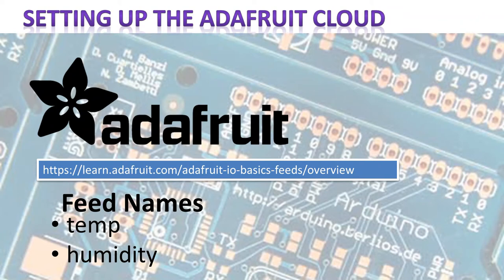Now we want to store the temperature and humidity data in the cloud so you can retrieve it later. Adafruit has their IO-based cloud. The easiest way is to follow the link in my blog — it will take you through how to create a feed. A feed is basically where you store the data. We're going to create two feeds; it's really important that you name them 'temp' and 'humidity'. It's a great tutorial — I don't see a point in trying to create a better one, they did an amazing job.